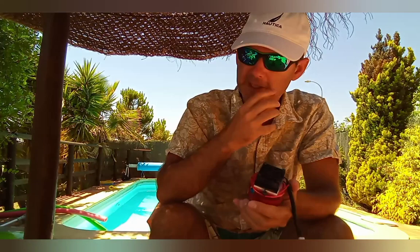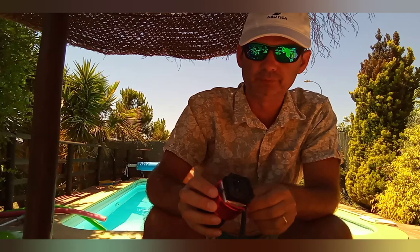But I can't record the video in the observatory right now because it's too hot. So what I did was to buy, and that's a difference also from all the other videos I saw, you have different peltier models. The termination of the number will give you the current, the amperes. So if it ends in 0.5, it's 5 amperes. If it ends in 0.6, 6. If it ends in 10, it's 10 amperes.